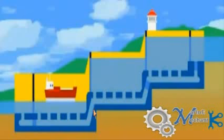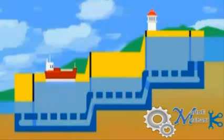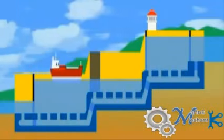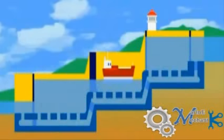And as you can see, the valve over here is now opened up. So the water from here just moves inside this lock, and then the ship gets lifted up. Let's see that. You can see the water level dropping here, and then it's rising here, and the valve is open here. All of the valves are shut. As it reaches the same level, the lock gates are opened so that the ship sails to the next lock, or it's being pulled by the locomotives. Alright, so it gets inside the next lock and it gets locked up.